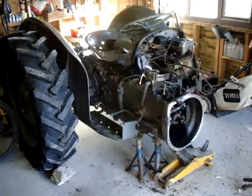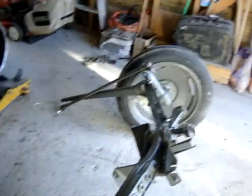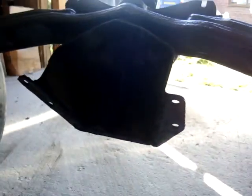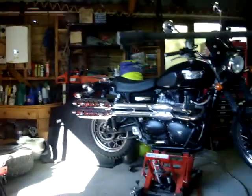So there we go — there's my little tractor in pieces. We just had to disconnect the front rods, the rods for the steering, and unbolted them. Basically what it was, we pushed it into the garage and just undid these. Four bolts on here — one, two, three, four — and basically we just undid all the bolts around here. Around this side you'll see it better. So basically we just undid all the bolts around there and brought the engine out with the engine crane, which is folded up over there now. And it came off fairly nicely and easily.